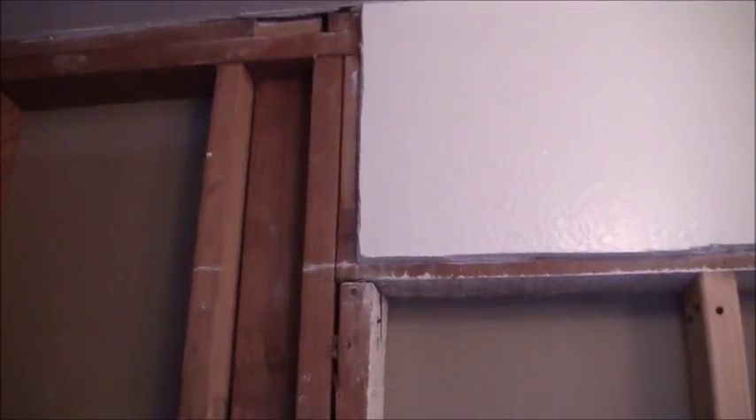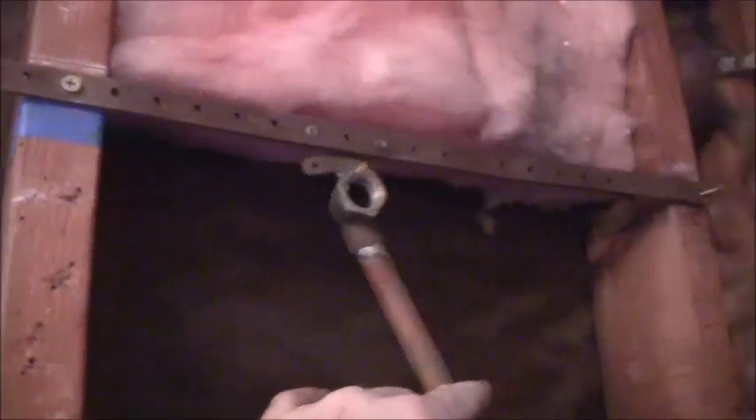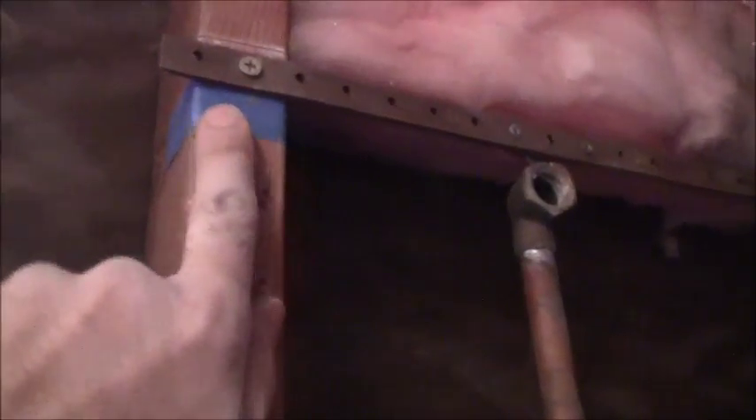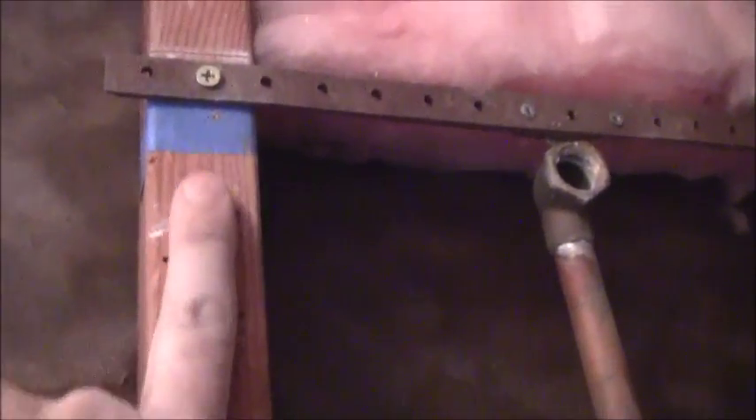I started working on my plumbing — I got it coming out. I know the niche is going to be between there and there, so I just had to go around that. Everything's working out fine. I got all the pieces dry fit, I'm going to sweat them in in a second. One thing before I sweat it in — one of the aluminum rivets broke off, so I'm just going to drill that out and re-secure it with a new aluminum rivet. I'm also going to notch out this 2x4 here on this side so this sits flush when it's landed.